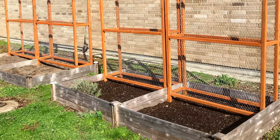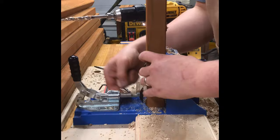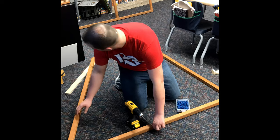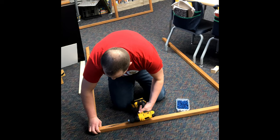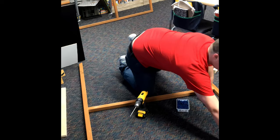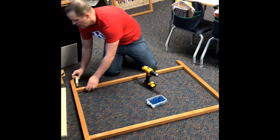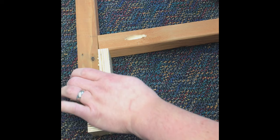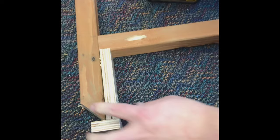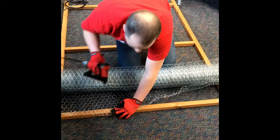So to this last trellis — chicken wire and pre-treated 2x2s — you're going to make a beautiful trellis that lasts. This is the pocket hole jig I use. Whether using a Kreg or any pocket hole jig, you just drill a lot of these holes that go at the angle and then you can assemble. These units I made for the garden at my school — I'm a fifth-grade teacher and I'm in my room just making some before students come. You're just drilling in these screws at the side. These screws work really well, and that pre-drilling really helps. Using those spacers for uniformity again.